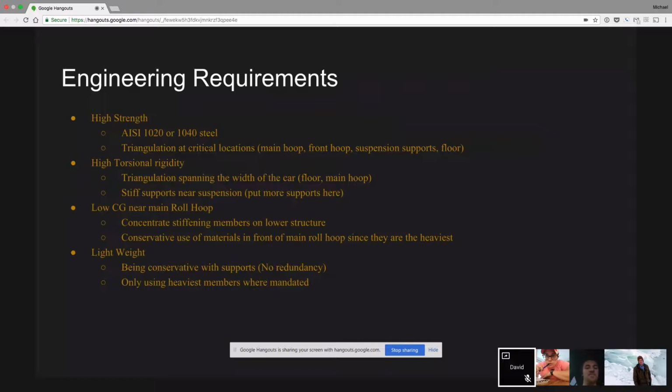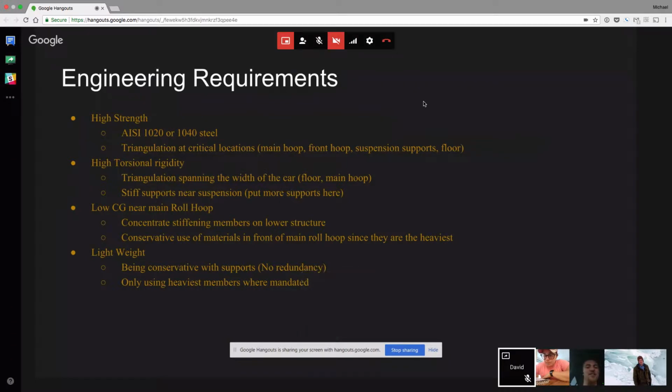We can get to high strength. After going to Iowa State, we switched from using SAE 4130 chrome moly to the 1020 or 1040 series steel. It's easier to get, mostly from sponsors. That's kind of the biggest point of the chassis. The other thing is, we have a state champion welder on our team. Chrome moly is inherently hard to weld, and you get distortion effects, and really we don't need to overcomplicate this thing, so we're just gonna stick to the basics.